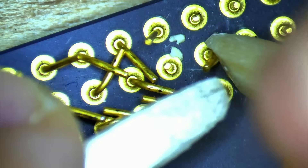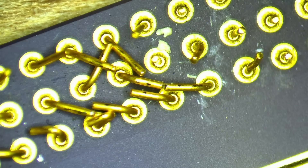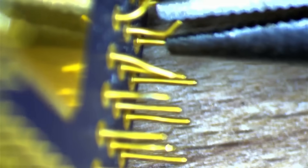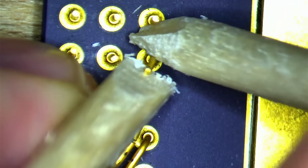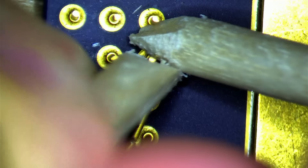There were about 10 pins on this CPU that required extreme caution and extreme measures. I tried my best to straighten those pins using the method I used on all other CPUs, but the wooden tools have only gotten me so far — the rest had to be done using pliers. Of course, I was as careful as I possibly could be; I just needed to get those horrible curves out. Once this was taken care of, I continued to work on the remaining pins, many of which were similar to other CPUs and went into place without a lot of effort.